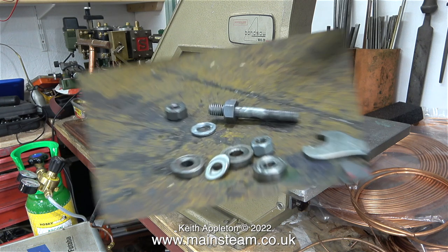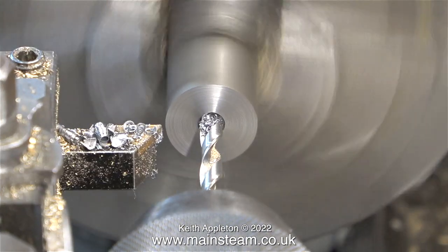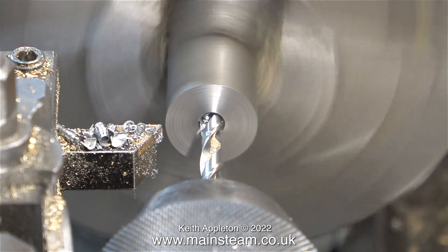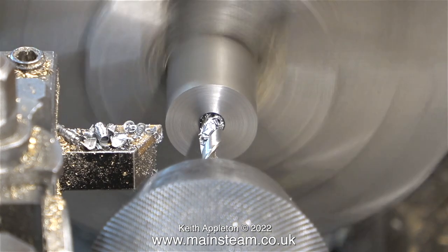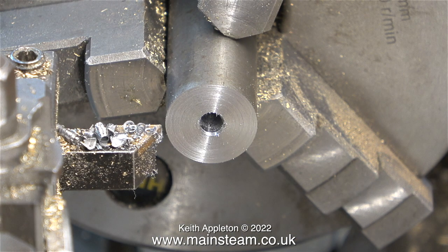I'm going to leave the bottom blade guide just as it is. This is the top one dismantled once again on the bench. The two large washers are made from hardened steel, but as the ball race is half an inch outside diameter, these washers are too small, so I need to make some more. With a larger diameter piece of steel in the chuck in my Boxford lathe, first I cleaned up the front by facing it across with a cutting tool, then I centre drilled it, and using a three sixteenths of an inch diameter drill, there's now a nice neat hole part of the way down the centre of the steel bar.